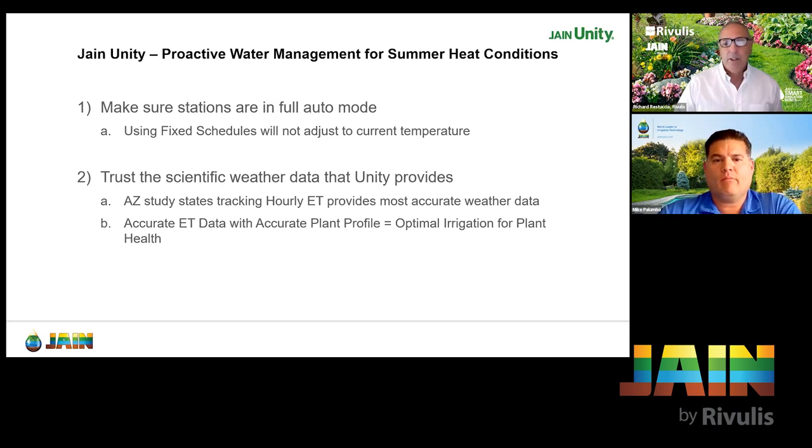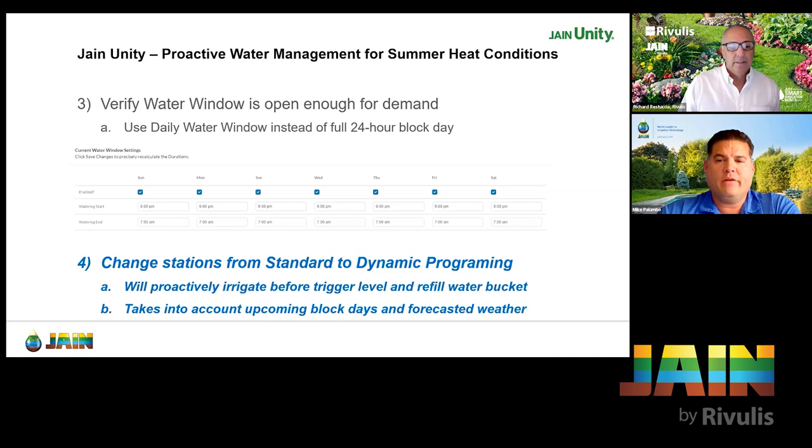I had so many branch managers when I was at Valleycrest who said we're going to save water but our landscapes are going to look terrible. But they quickly saw that if you were applying the right amount of water, you had really healthy plants with great vigor. You train those roots to the certain depth you need, and they'll be able to take a little bit less water down the road. It's definitely crucial to put the right amount down.